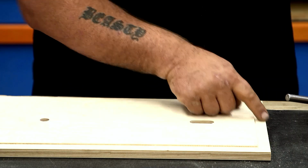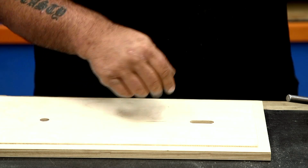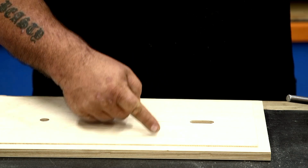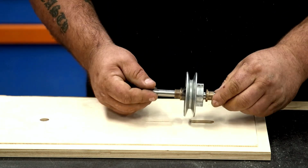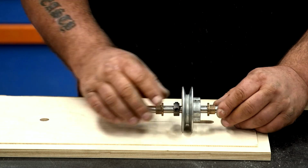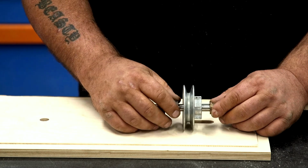So you see these lips I cut into the bottom of the top. Those are there for a very specific reason. They help me mount the side panels, and they give me a measurement right now, so I know exactly how wide the C carriage that goes in here has to be. Now that C carriage is gonna hold my pulley and my bearings and my stop block, and that's gonna be what moves back and forth to put tension on the system.